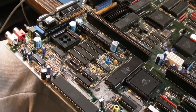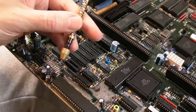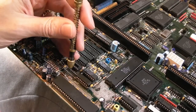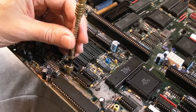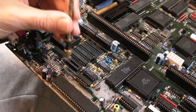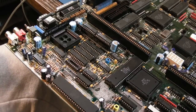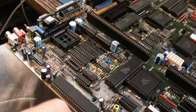Anyway, that is looking nice and straight and level, and all the pins are through. So I just commit to soldering that on, and then I need to unblock the holes on the underside of this one here. The other thing I've been doing here is ground and VCC. If you can't unblock them, just try and remove as much solder as you can so you get a little dimple in the surface, and then use a drill bit that is exactly the same size as the holes, or potentially marginally smaller. This one's exactly the right size though. And then you avoid putting too much heat onto those ground and VCC pads, because you'll lose pads on these. I haven't lost any yet, but some of the solder mask has worn away on the other side, and you can see a little bit of heat damage from where I struggled at the start trying to remove one or two things on here.